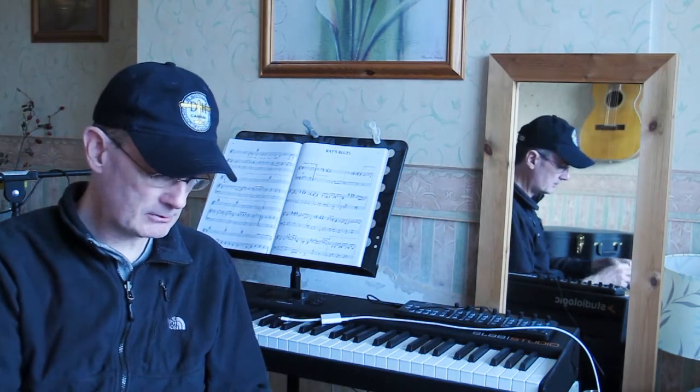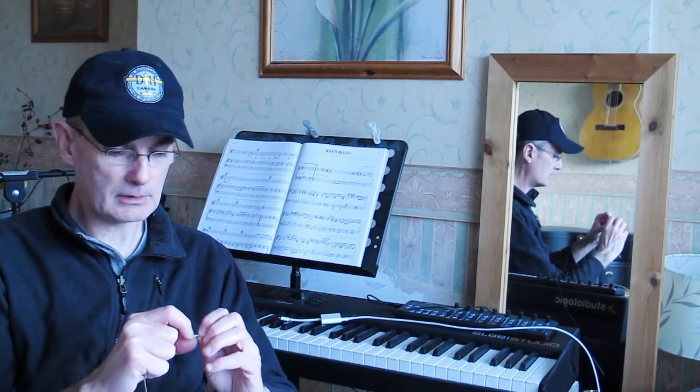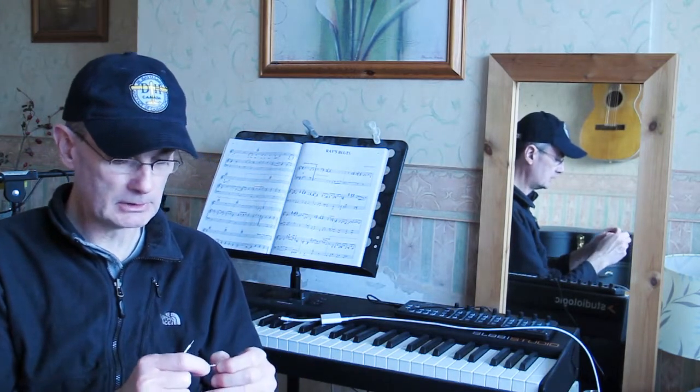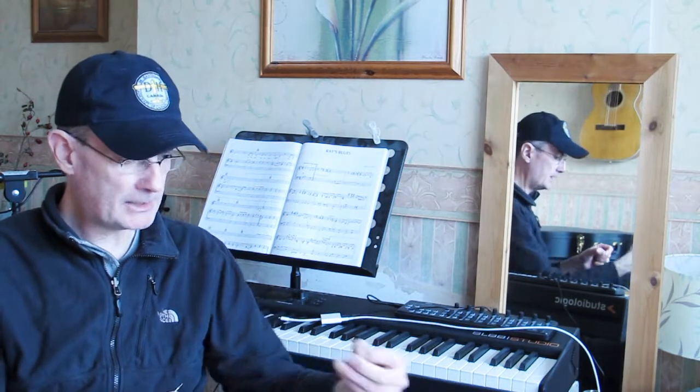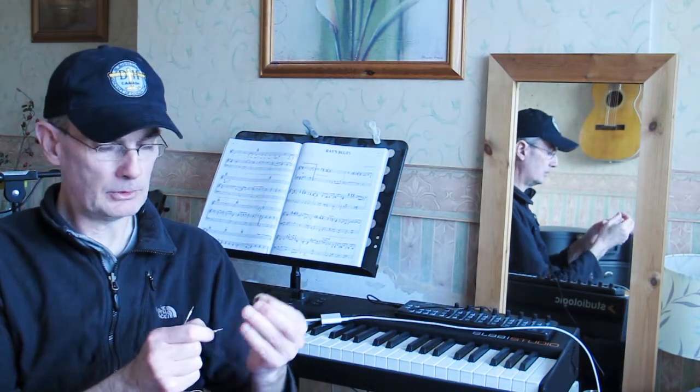And that's because there's three different things on this pin that you need to be aware of. There's two things that get crimped independently to different thicknesses. One is the thing that holds the insulation for the end of the wire. The second thing is the two little flaps that actually crimp to the wire and make the electrical connection. The third thing is a little square blob that engages with a spring clip on the connector.